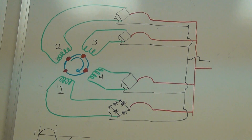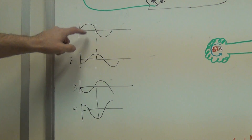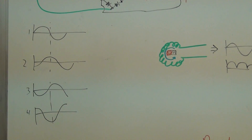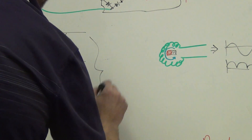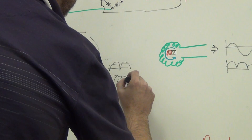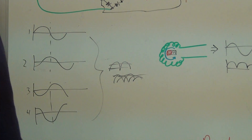A lot of that can actually be simplified. What I'm trying to do there is, if you look at those same four ones, the first one's going to be having a hump here and they're down here, and the second one will be all what's called out of phase. Ideally what ends up happening is when you add all of these together, instead of having a lump like this, you end up with something that's very, very smooth. I still have to use a capacitor on that, but it's still fairly straightforward.